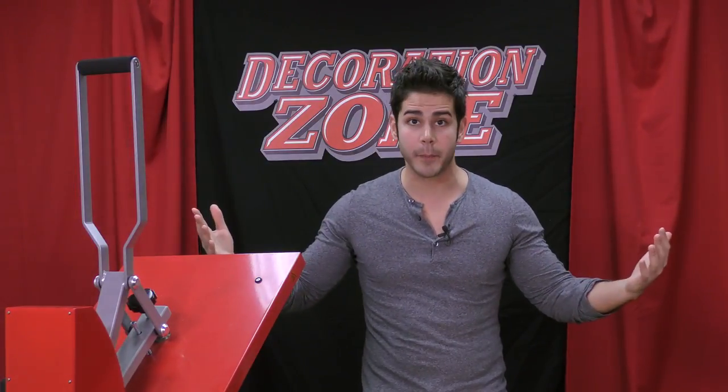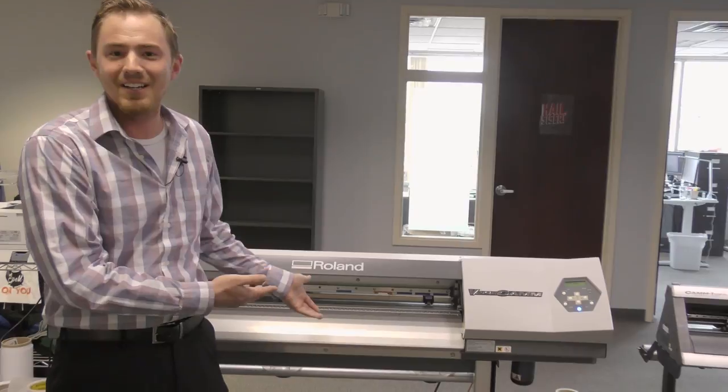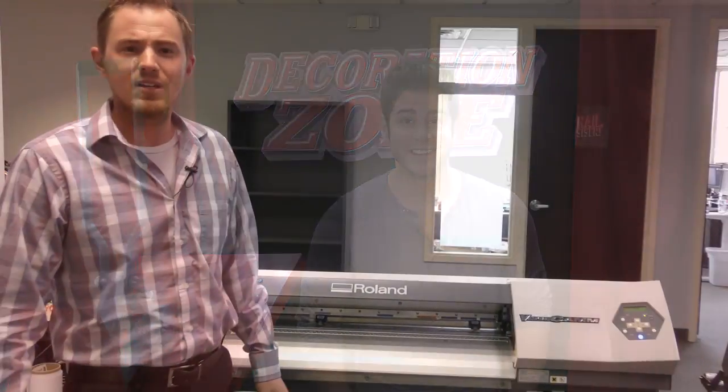These are often considered wide format printers. They range from about 20 inches in width and up. Some of the big manufacturers on the market right now are Roland, HP, Mimaki, or Mutoh. Our print and cut materials work with these inks because the pigments in the inks work with the receptive coating of our print and cut materials, so you don't need to worry about your image disappearing in the wash. Other inks might work initially, but they're not going to last in the wash.